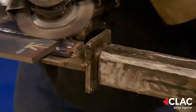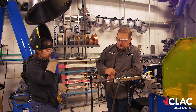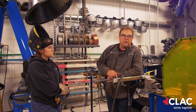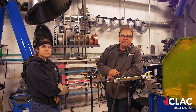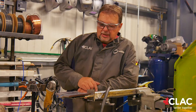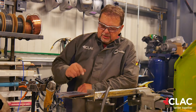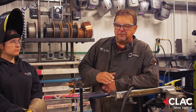The end result is a nice plate welded out — not too wide, not too heavy. You're allowed a maximum reinforcement of one eighth of an inch; if it's over that, it's a fail. On CWB day you've got 45 minutes to weld the plate out for each position. She did it in ample time, though a lot of people do time out. She has used the run-on tab and the runoff tab. Her cap is nice and flush — job well done. That's the test plate welded out on test day.